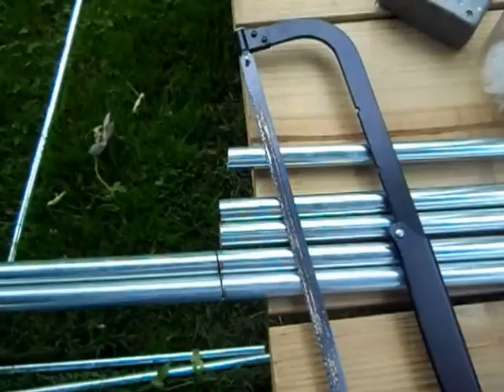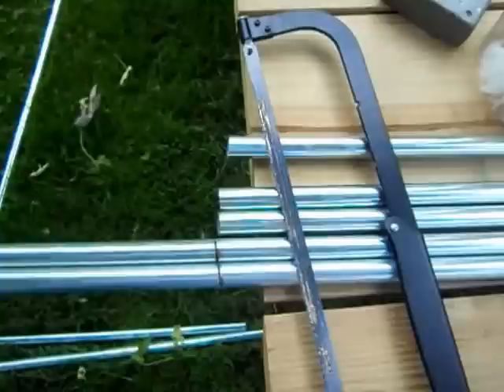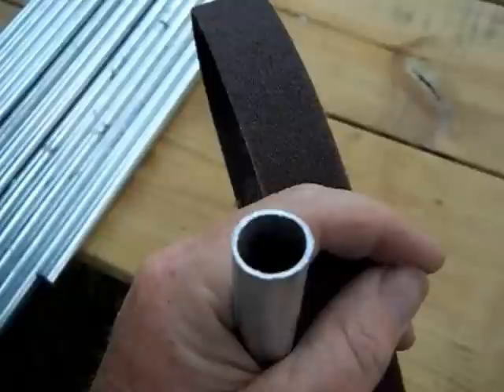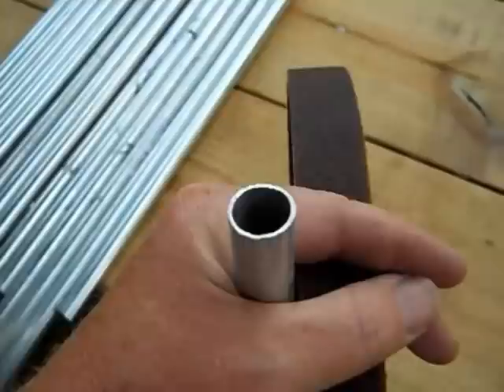Here's the part where I have to tell you — it took me five minutes to fix this cheap Chinese hacksaw. You can't cut straight with it. I went in and smashed the rivets in the vise to put it back together. After you're done hacksawing and drilling your holes, you're going to have some nasty burrs, so take a piece of coarse sandpaper and smooth those off so you don't cut yourself while putting up the fence.